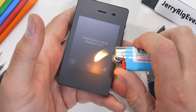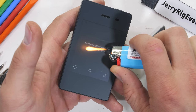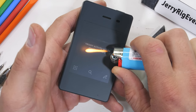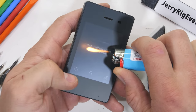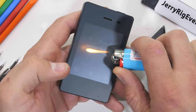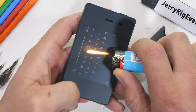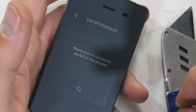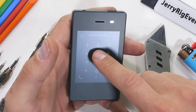We've never burned an e-ink display before. Each pixel only has two colors — black and white — and can flash back and forth between the two. But the screen doesn't use power to maintain what state that pixel is left in, like a normal AMOLED or LCD would. It's kind of like an Etch-a-Sketch — once it is that color, it stays that color until it's refreshed. You can see as I flip through the screens there's a bright flash of all the pixels switching to their new orientation, and sometimes there's a bit of ghosting from what was left on the screen before. But interestingly enough, even after 50 seconds of burning, the e-ink display appears to have no damage. Everything, surprisingly, still works. Thumbs up for that.